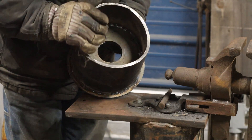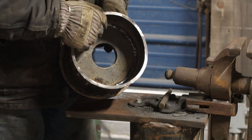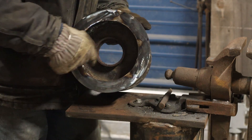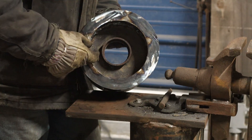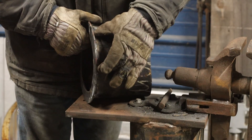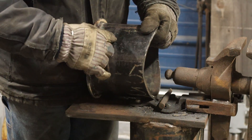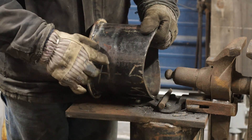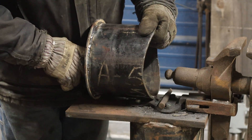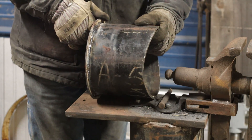The exhaust is going to pull through here, pulled in by the inducer motor into this ring. We're going to have our four-inch pipe coming off the side here. The four-inch pipe — we're going to have to shape the end of it kind of rectangular so it all fits and we can get all the surface area we need inside the actual squirrel cage itself. I don't want any on the other side of that pipe.